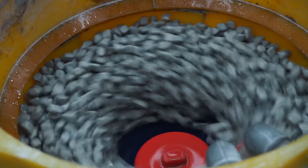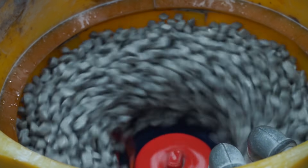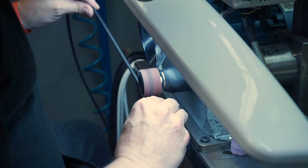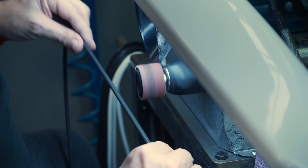Drumming: the O-rings are placed in a drum of rotating stones, which rub the excess flash off. Buffing: larger O-rings are placed under a buffing wheel. The abrasive action rubs the flash off.